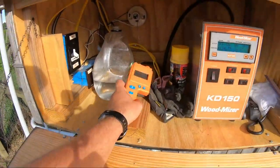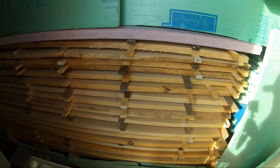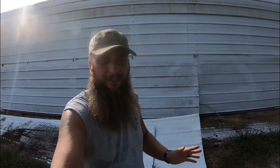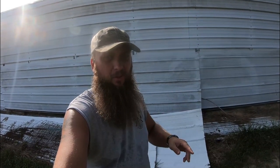Let's grab the moisture meter - this is my Delmhurst moisture meter right here. Once I get down to 8% or less on all my readings, probably by lunchtime tomorrow, we'll be down to 8% or 7% on most of those boards. At that time I'll go ahead and cut the vents off, turn off the compressor, throw the heat up to 150 degrees. We'll get it up to that temperature and hold it for 24 hours, which will sterilize the lumber. After 24 hours, I'll shut off the kiln completely, open up the vents, and let that wood sit in there for another 24 hours to cool down on its own with the vents open letting the heat get out. It works out pretty good usually.